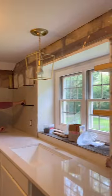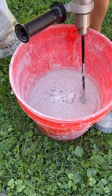Now that we covered floating shelves, let's talk about how we installed this stone backsplash. The first thing we did was tape out all of our seams with cement board tape. This gave us a smooth surface to spread the mortar, then mixed up some heavy-duty mortar, getting it to a peanut butter consistency.